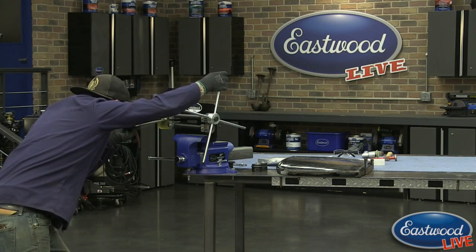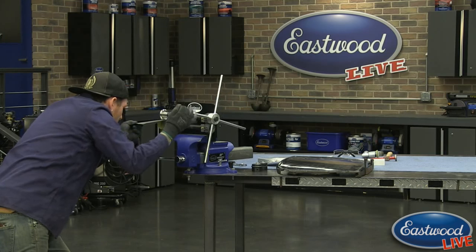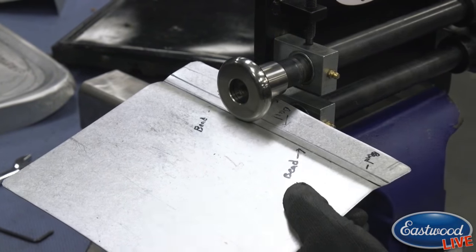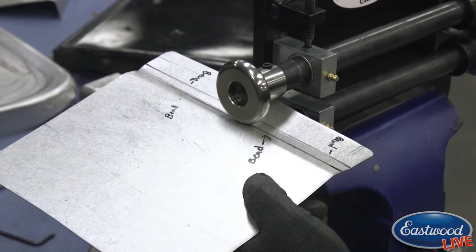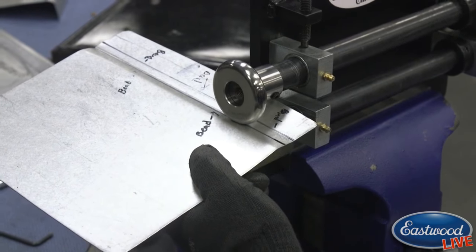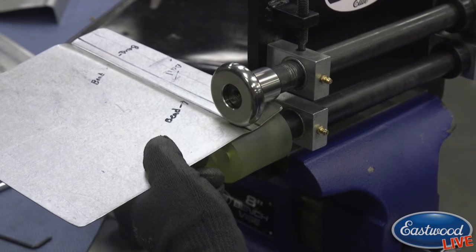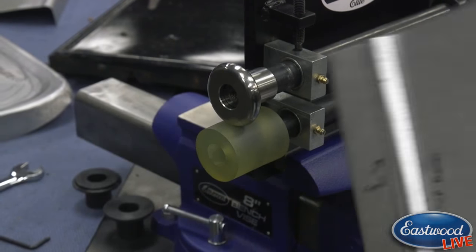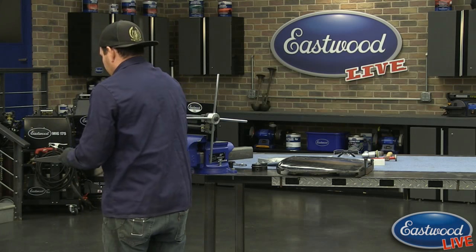Again, because I'm operating this bead roller, I can really focus. And once you get your beads started, a lot of times if you're running straight beads like this, you don't have to do much with the panel, but just guide it. So you just make sure it's kind of finding its course. And you can run it, and with the 4-post handle like this, I can just keep moving and I don't have to search for the handle. So we got our peak here.